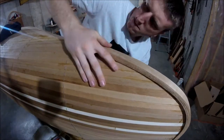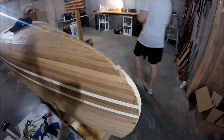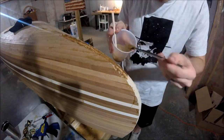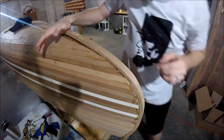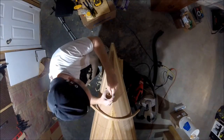After removing the appropriate amount of cedar strips to embed my outside stem, I realized I still had a little bit of spring back in my outside stem. So I'm going to use some epoxy and then countersink some screws to hold it in place while the epoxy dries. Once again I'm using West Systems Epoxy — while it certainly isn't cheap, I can't imagine anything that's much more user-friendly. I use some of the thickener to make it more of a glue texture and just brush this on to the end of the canoe before attaching my outside stem.